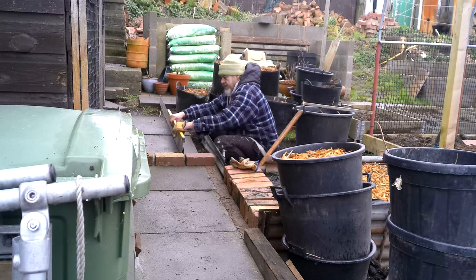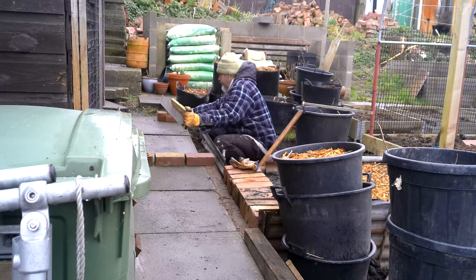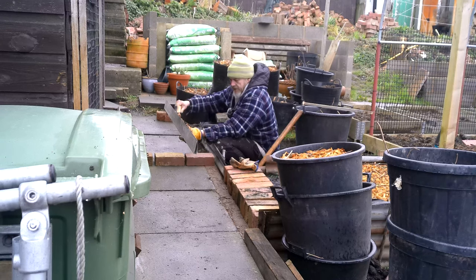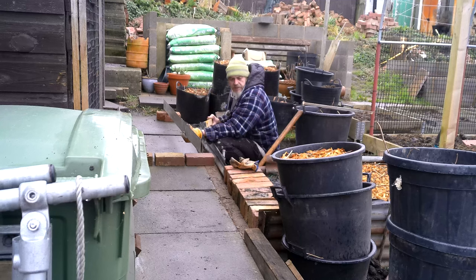What sort of height would that be? Put this brick in there at a level position. That's it. I think we can get another row of bricks there and the slab on top, to be honest. That's got to be 6 inches, isn't it? So that's what's going to happen then. We're going to have two courses of bricks there, then the slab, and then run them up to meet them up there.